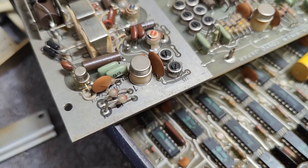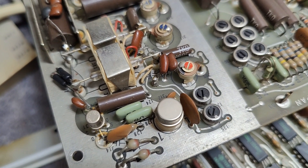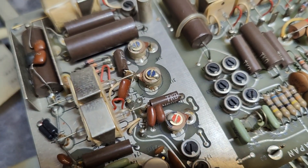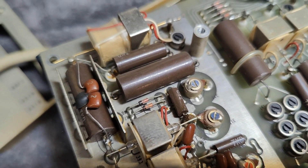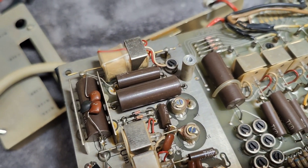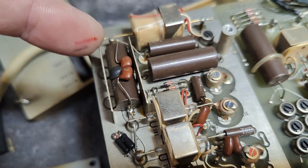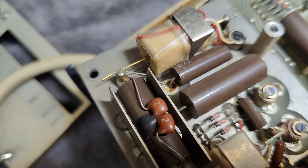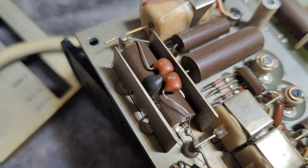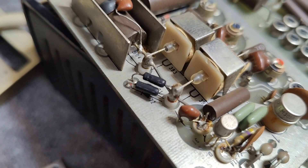I'm very sure this is the AC amplifier section and the AC-to-DC converting. We've also got a little bit of trimmers and variable capacitors across some other resistors — that's definitely to handle frequency range. Again, we've got some reed relays and all that kind of stuff. There's a resistor with two two-picofarad capacitors in series across it to speed it up a little bit, plus overvoltage input protection.